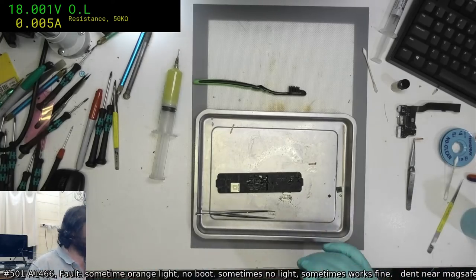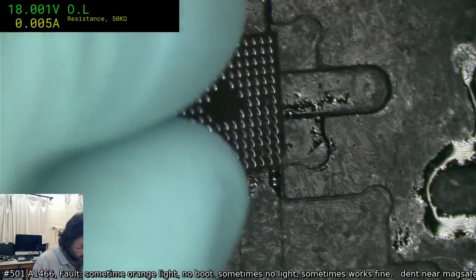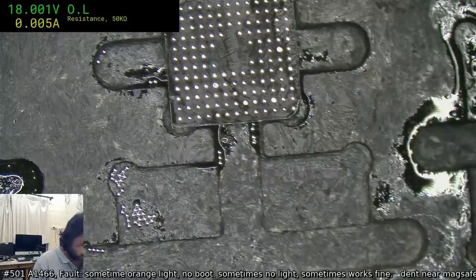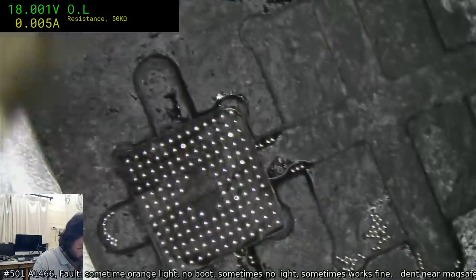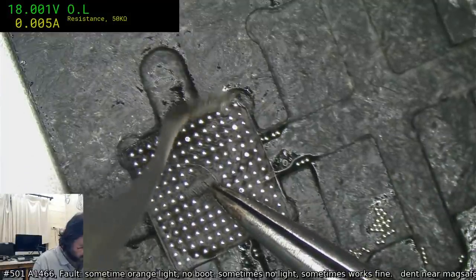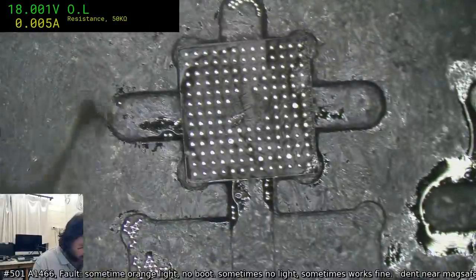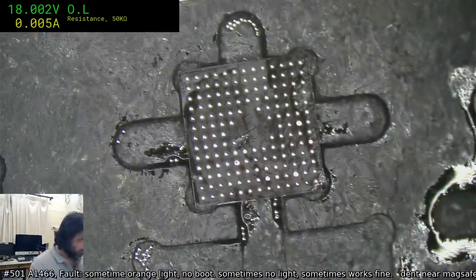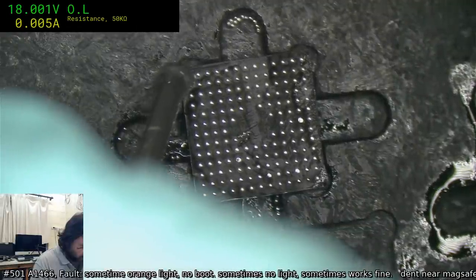You don't want flux and liquid sitting in that recess. Okay, that's not too bad. It's not great, but it's not too bad. Oh, and look, that damned bit of whatchamacallit still there, edge bonding or whatever. But anyway, you don't want, oh great, and there's cat hair, fantastic, flux or other things like that sitting around too much in this holding area, because otherwise what will happen is as you heat it up to reflow, it has a bad habit of wicking up and under your stencil and messing up the whole process.